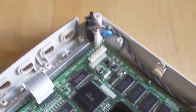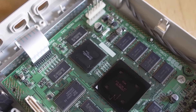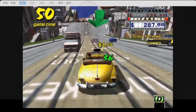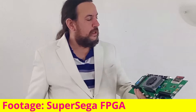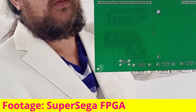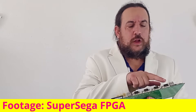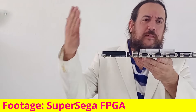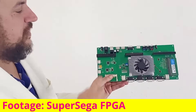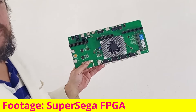Nothing about this project adds up whatsoever, outside of the fact that they're now asking for $3 deposits that come with a guarantee they can charge your card at any point in time for the full balance, even if they don't deliver the actual project. Since the inception of this project when they showed off Dreamcast footage running, nothing about it looked right. Examining the PCB further, we can tell that the USB port they're controlling it with is just a pass-through — the traces go directly to a USB port on the back. Eagle-eyed viewers also found that the HDMI port they were outputting video from had solder bridges between pins, making it completely non-functional for video output.